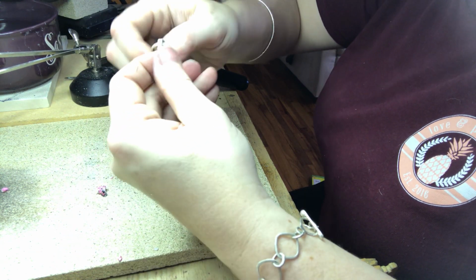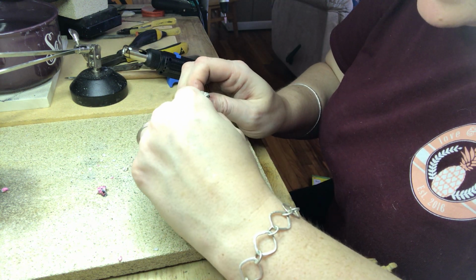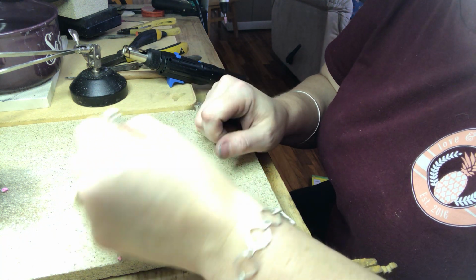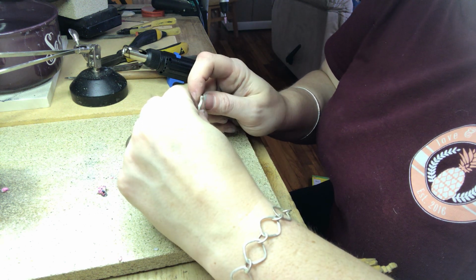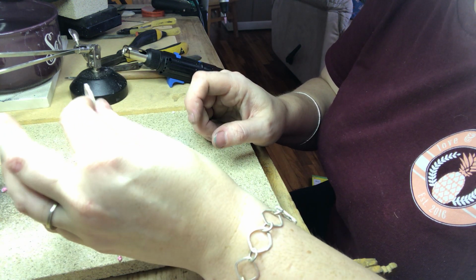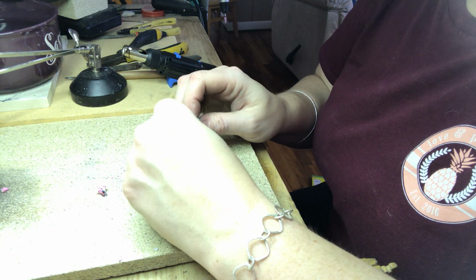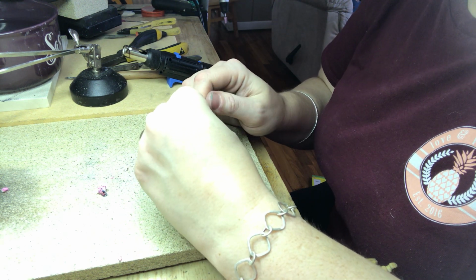Now, I have pickled this, so I could, or should really, probably, go back in here and cover it with the Cool Jewel again. But because I know you can heat diamonds, you just don't quench after. So don't forget, do not quench it. Just let it air cool, and then you can dip it in water and put it in your pickle. And if I'm not mistaken, though, that only applies if it's a good clarity diamond as well.